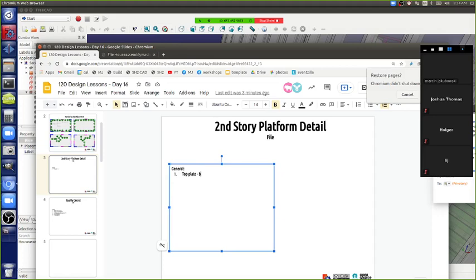True. So top plate, short side, use a 16 footer, overlaps the long side wall panels. Now it turns out that there are not going to be two 16s; they're going to be slightly shorter on the long side because we're cutting out... oh, actually these are 2 by 6s for the top plate. So use 2 by 6 for the top plate.